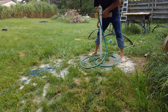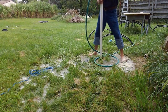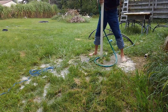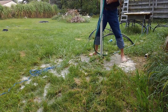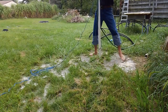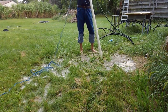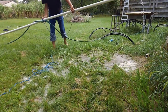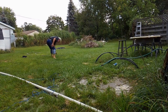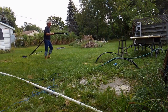This hole's done now. The black tubes that have been prepared are now ready. One of the things that we've done with those tubes is to straighten out as much as possible the first six feet by bending and trying as best you can to straighten it. Because if it's curly, it's going to dig into the side of the well as it goes down, knock dirt down, and dirt will go down before you.